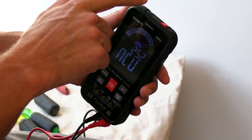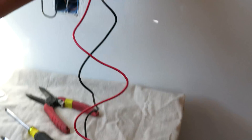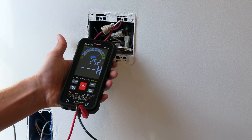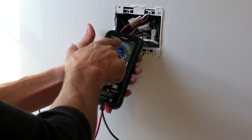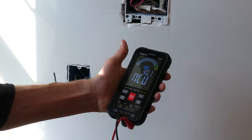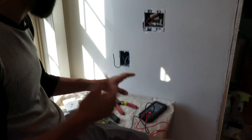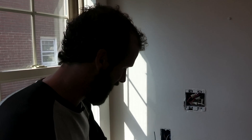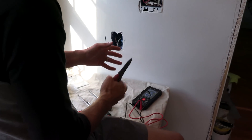It's extremely compact. It's got non-contact voltage detection built in, which I absolutely love. Low and high sensitivity, audible indicator, visual indicator — that's a really nice feature. Auto shut-off, flashlight — it's got basically everything. I just have to become proficient in a new kind of topology. So we're confident that our GFCI circuit is de-energized. Let's throw this in the wall.